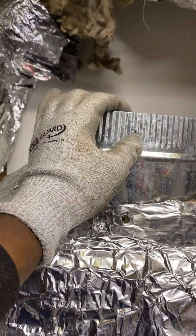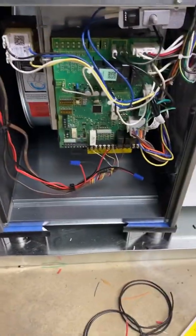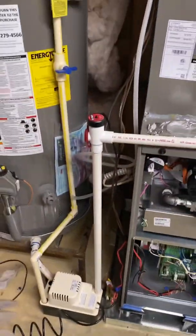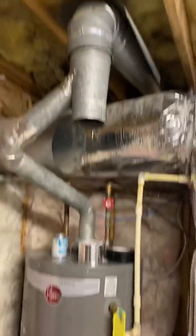Put a 10 here — these two tens go on the bottom, and this 10 right here is going on top. I think that's gonna be our move. Wired up low voltage, ran it in nice and neat, wired up single stage. Ran a new line set — it was five-eighths. Did the drain going to a new condo pump, easy trap. Let's go — what we have left is ductwork and flue pipe.